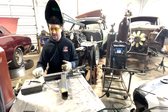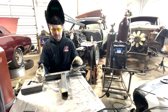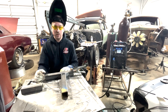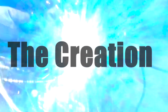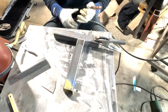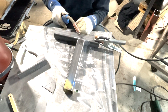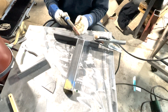Let's tack this thing together. I'm going to put a small spacer underneath to get it level. Perfect 90 degrees isn't the biggest concern here — otherwise I'd have it clamped in a fixture. What I'll do first is tack weld the corners. The reason I tack corners is so that if I look at it and don't like the alignment, it's easy to get in with a grinder and cut the tacks loose and redo them. I'm going to focus heat on the thicker piece of metal and let it flow downhill — gravity will carry the wire right into the joint.